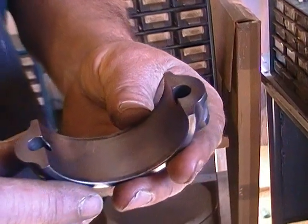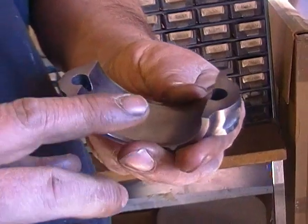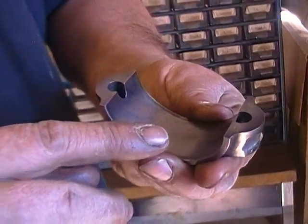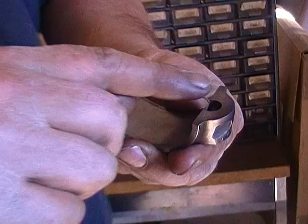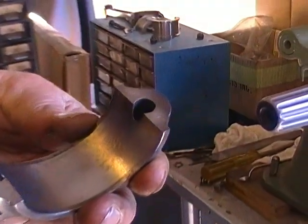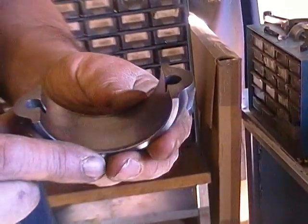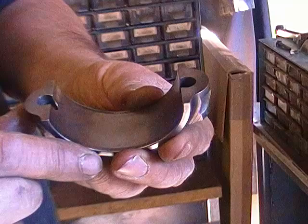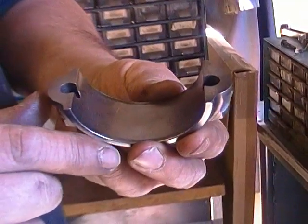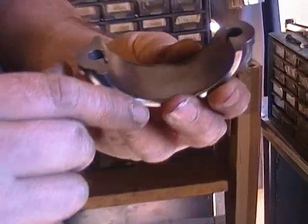What we're doing here is repairing a connecting rod cap that has been worked on a flat plate using sandpaper or damaged with a file. You can see from the light versus dark areas that the cap has low spots on it, and if the bearing shims or bearings are set up on this cap, you'll end up with a potential for lost crush and your cap and rod won't be properly aligned.